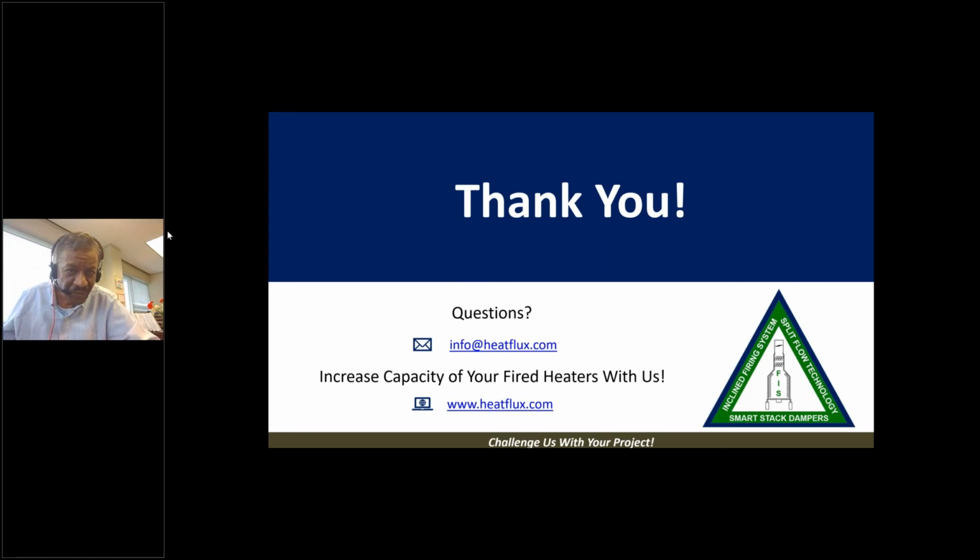Okay, I got it now. What kind of revamp do we have to do if you want to use a furnace with design duty of 11 megawatt at a reduced duty, reduced by 30%? I think you have to re-rate the heater at a lower duty and make sure that the burners can be correctly sized. Also, the stack and the minimum tube metal temperature, so that there is no dew point corrosion in the heater.